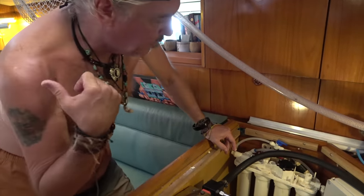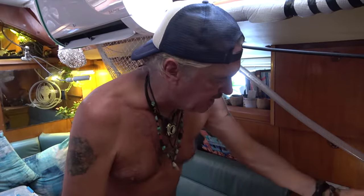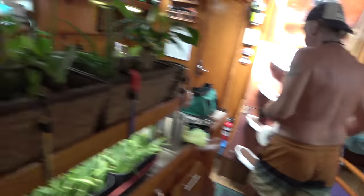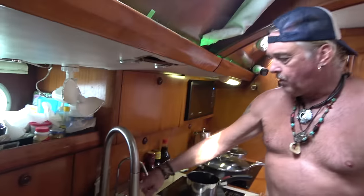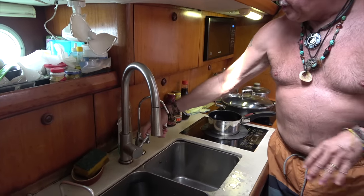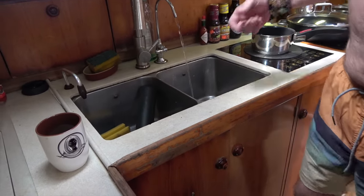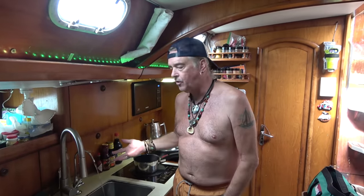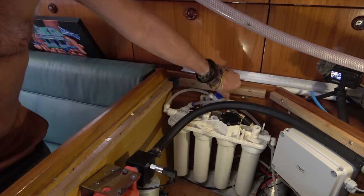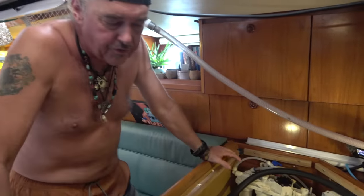We're going to open up that faucet, run it out of water, then close off the valve for the pressure tank and turn off the power to the water pump. Then we can disconnect the inlets and outlets and work at the sink where it's more convenient. This small faucet here is strictly for drinking, cooking, and consumable water — the desalinated water from the Schenker system goes to the utility faucet, and this one is just for drinking. We want to flush it out completely because we're changing everything including the carbon filters, not just the pre-filter sediment filter.